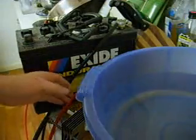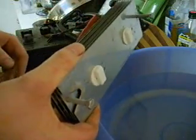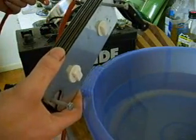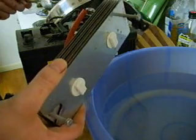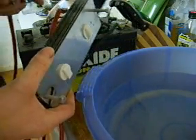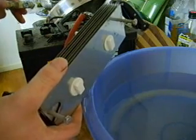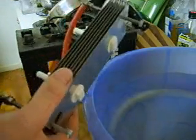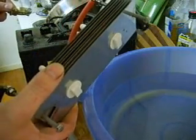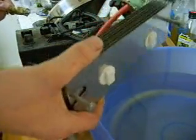We're going to try out this 8-plate system. Before I do that, if you're trying this at the very early stages without having a fuse and a proper switch setup, there's a little trick: make sure you haven't created any hydrogen yet, then quickly brush the cables past to see whether there are any short circuits in your plates. If there are any sparks, you've probably got a short. Don't do it with the cell in the water, because you will get sparks.